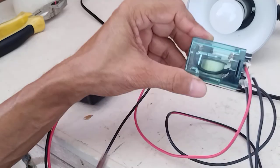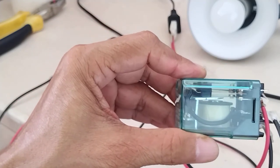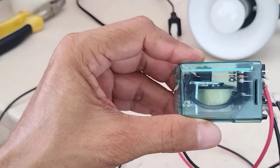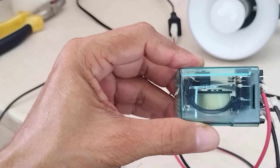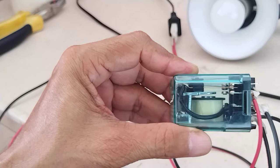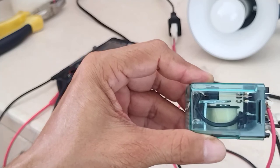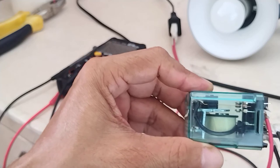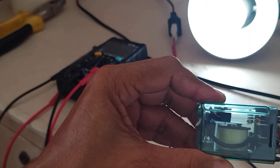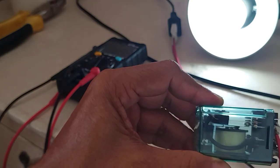Let me repeat it again. There is some time delay in my transformer. The relay will go to the normal position, which is the normally closed contact. When de-energized, the contact returns to normally closed; when energized, it transfers to normally open. The purpose of this relay is just to turn on a device or a lamp. This is not the advisable way of testing it, but since I don't have the base of this relay, I'm using this transparent one so we can see clearly the contact position.